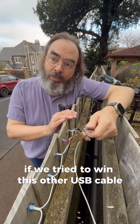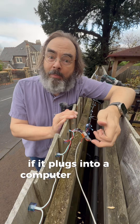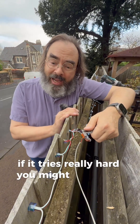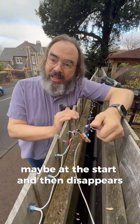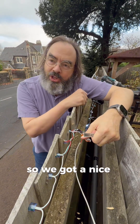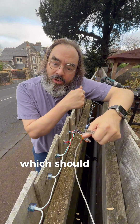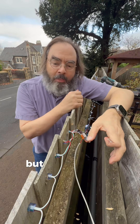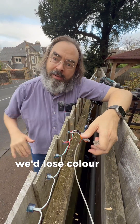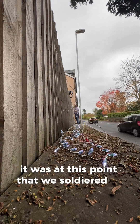If you tried to run this off USB, the USB power supply would probably trip and say no. Plugged into a computer it would definitely say no. If it tries really hard you might get some lights at the start and then it disappears — it just doesn't work properly. So we've got a nice juicy power supply, I think 20 amps, which should have no trouble with the current. But we still have voltage drop, so even with that, if we didn't have the mid-feed we'd lose color and brightness by the end.